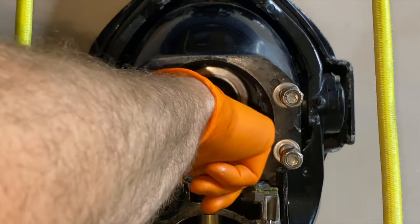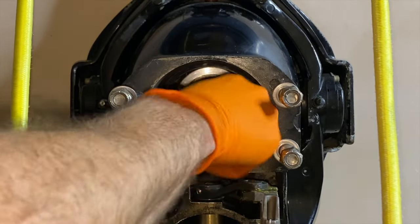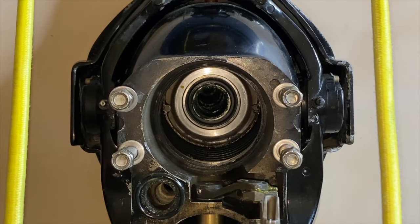Next, I'll lubricate the edge or surface of the larger O-ring closest to us. You might see people use Bellows adhesive, but that is the last thing I'm going to use because our serial number service manual does not call for it. If the engineers thought that was a better option, they would have issued a memo or service bulletin informing all owners, technicians, and marine shops of the change. There's no memo or service bulletin on our exact serial number service manual informing us that Bellows adhesive is a better application on the O-rings than 2-4C. Just keep that in mind.